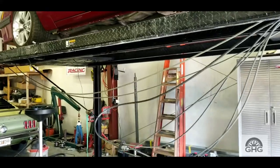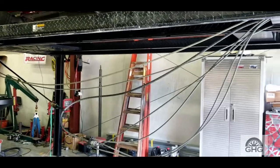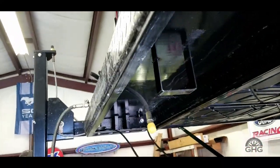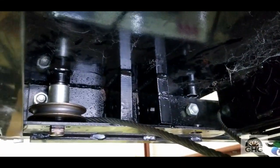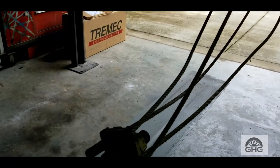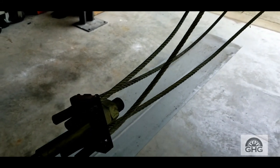What a rat's nest. I didn't film removing the cylinder, but as you can see the cables are drooping down — you can see underneath where the cylinder goes. There's a pin with a little hanger that holds it up, and then it hooks up with another pulley on this larger cable that pulls on the four cables here that lift the four-post lift.